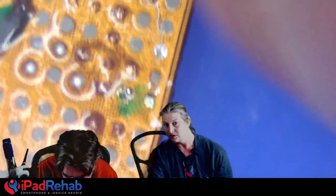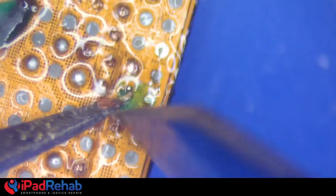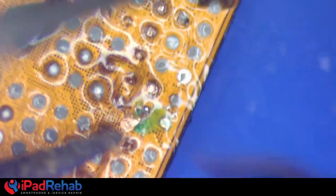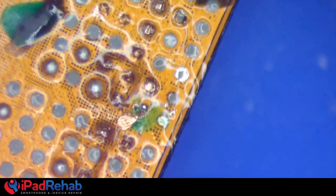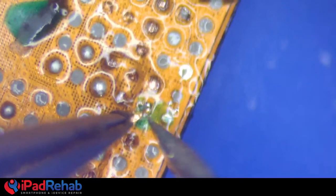So he's peeled off this little pad sticker, and now he's going to try to attach that pad sticker to this torn pad to replace it. Well, the back of the thing doesn't have any adhesive. Otherwise, it wouldn't solder on very well. All right, so now, because I'm going straight on top of where the pad was, I don't really need the tail. It does come with some that are cut just as circles, but the ones that are the right size for this particular job all have tails.